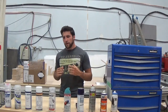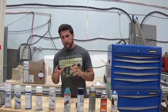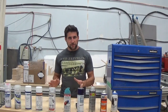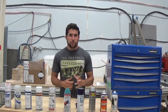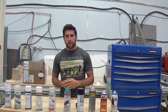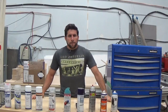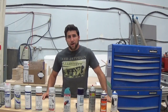And finally: adhesion problems from not sanding. For some reason people are spraying stuff and then they're scared to sand it afterward. They think, oh that looks good, I'll just spray over it with clear coat and seal it in there. That doesn't always work. If you're using a gloss paint that's not a lacquer — because lacquer melts into itself — but a gloss polyurethane or an enamel, and you spray it out, let it dry overnight, and then just spray clear coat right over it, there's a good chance that clear coat's not going to stick properly and it might peel off.